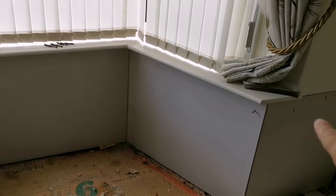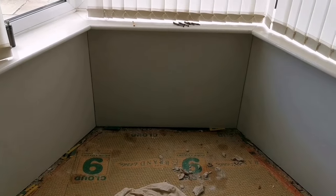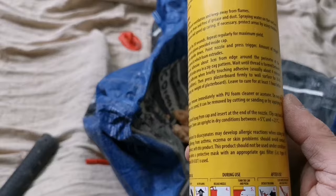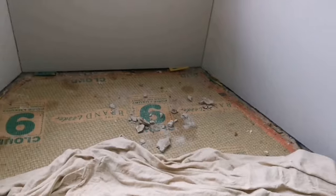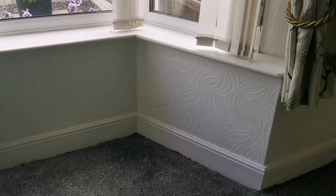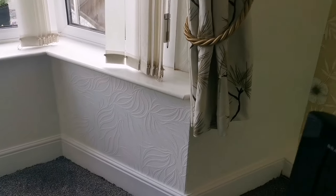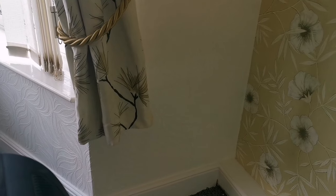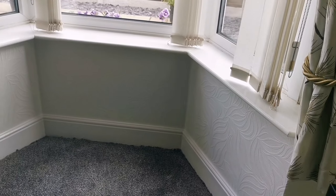So we've got that on. I'll just put a little nail in there and a couple in that end just to hold it while it sets. It goes off in about an hour. So that's it — we've had a bash at the wallpaper too. No skirtings on yet, but yeah, we're filming the other job as well so I couldn't really film much of this, but it's all done and sorted. You get the gist of it with the damp proofing. See you later guys.